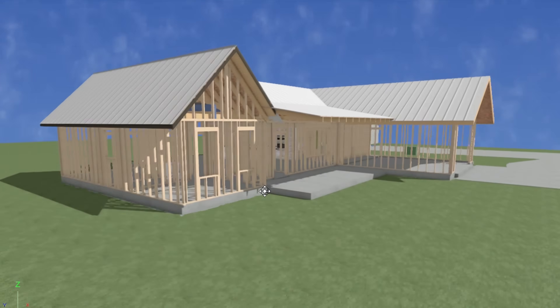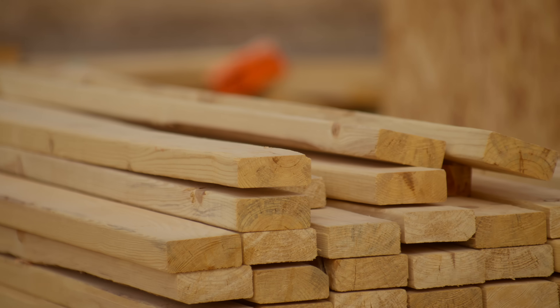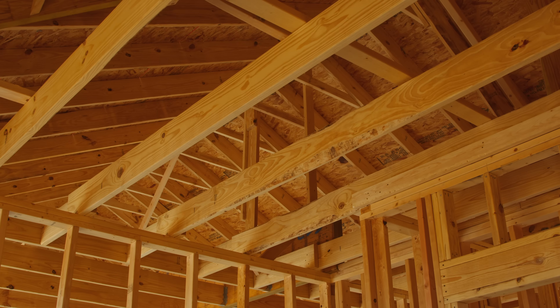Let's get right into the actual model, and I'll build this wall out so you can see it visually. Here we have the studs of our walls. We went with a 2x4 wall on this because it's cheaper than a 2x6. It gives us all the structure we need, and because we're doing exterior insulation, we're not needing that big cavity to fill full of insulation.